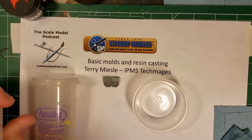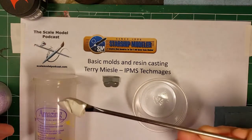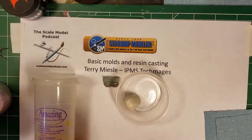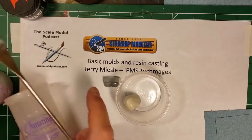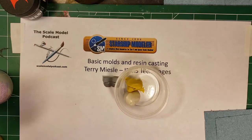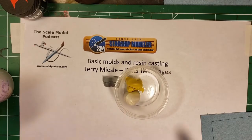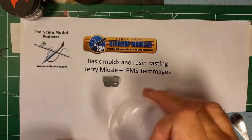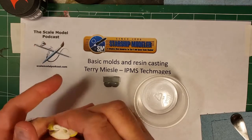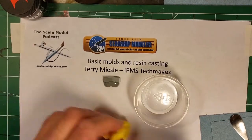I'm going to get two equal parts out with my little spatula. You won't need a lot. I'm cleaning it with some water and I'll probably take some alcohol to it later. I'm going to mix — you can see there are two different colors so you can tell when they're easily mixed. And just like epoxy putty, once you think you're fully mixed, mix it for a little while longer.